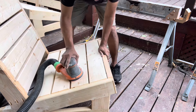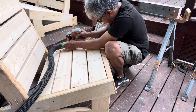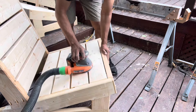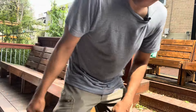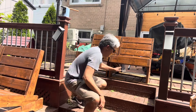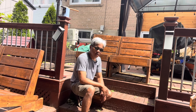When I bought the dowel, I made sure the dowel color was very close to the wood I used, so that when you stain it, it doesn't show all that end grain from the dowel. The dowel will absorb the stain and create a visible oval mark. What I do is wipe a little thin coat of glue on the end grain and then sand it. That really helps — when it dries and you sand it, it won't absorb the stain and the color stays the same as the surrounding wood.